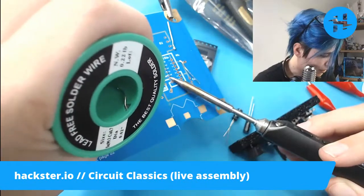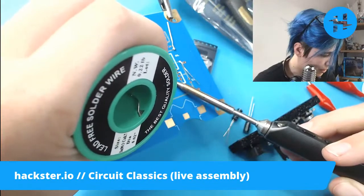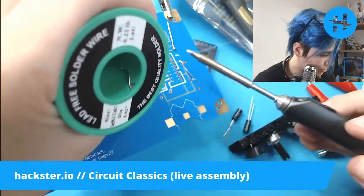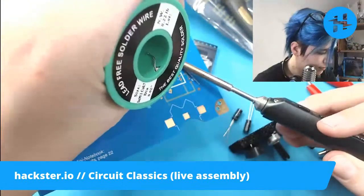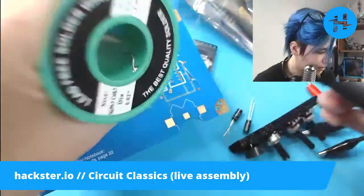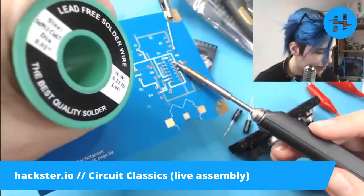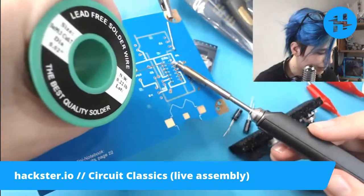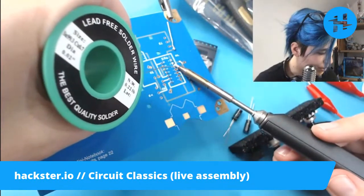Fourteen pins in all on this chip. It's sort of a dual version of the 555, which has 8 pins. I'm assuming that they share ground and voltage. That's probably why there's 2 fewer. Then you've got trigger and reset pins.